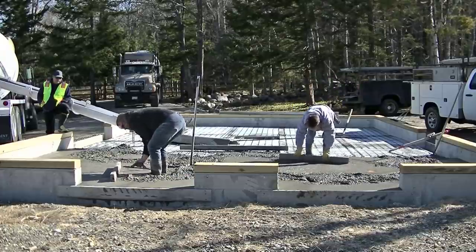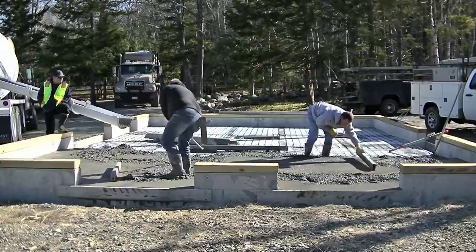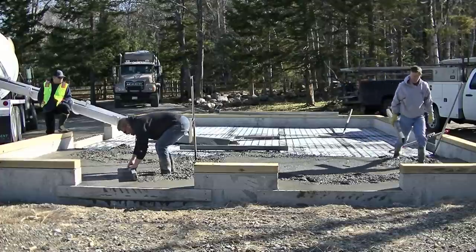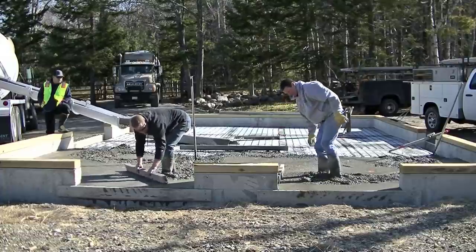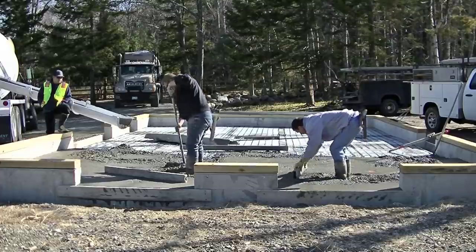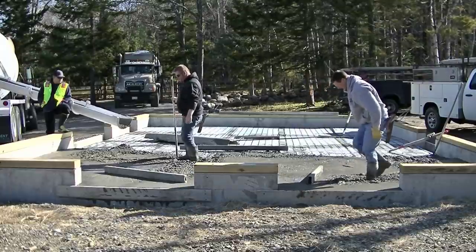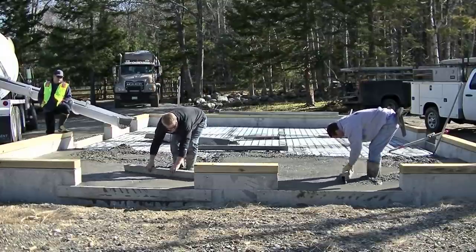You can see Luke's just taking his time, taking a few pulls at a time with a straight edge to level the concrete. Making sure everything's perfect. I'm over there checking the pitch on mine. And this is how you screed around a floor drain if you want to get some really good pitch to a pretty good size area. You got to have your high points, and then you got to jump in there with the right size screed and just slowly work your way around the drain.